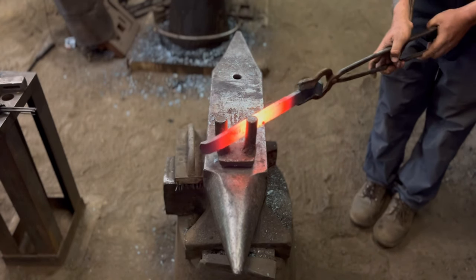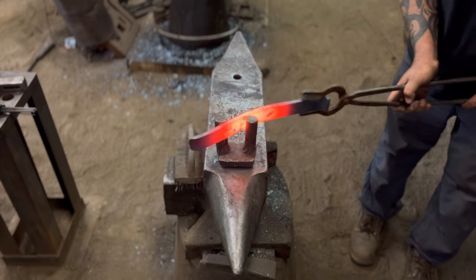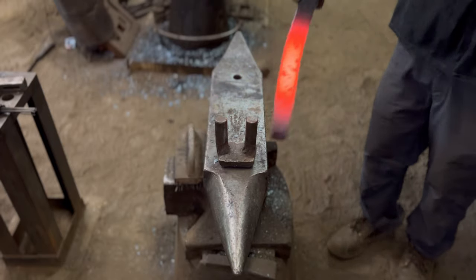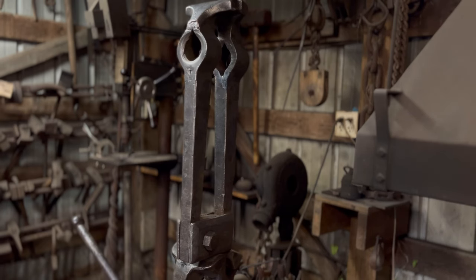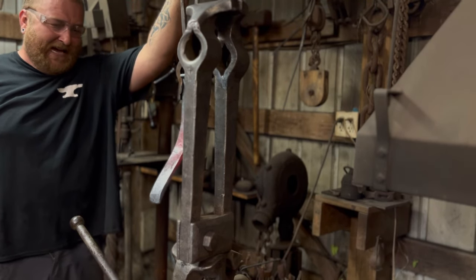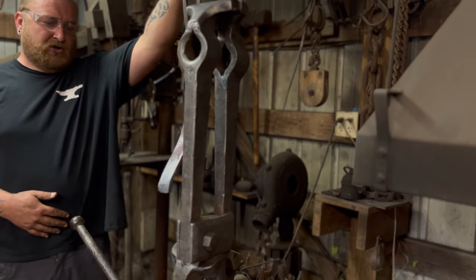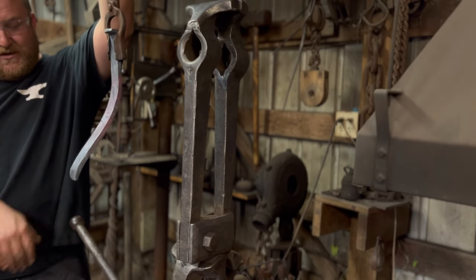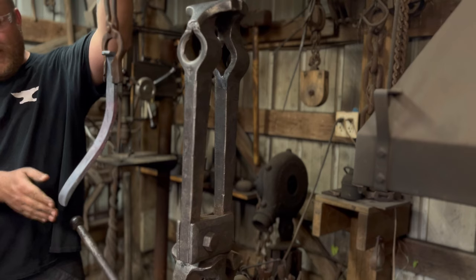There's no real rhyme or reason to it. You obviously want to make sure you're bending it the right way, but I just try and get a nice gradual arch - not too aggressive, not too crazy. These springs get put under a lot of tension so you don't want it super bent. Now basically what I do is I just come over here and eyeball it. You can see I'm going to back against that static jaw on the back but also be able to push against the dynamic jaw. The arch looks very good. I might curve this down just a little bit - that'll help the mating surfaces where the dynamic jaw and spring touch, push a lot easier instead of getting hung up.